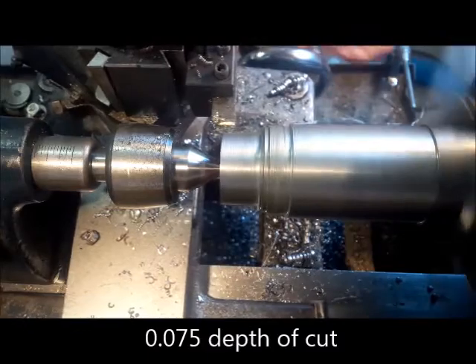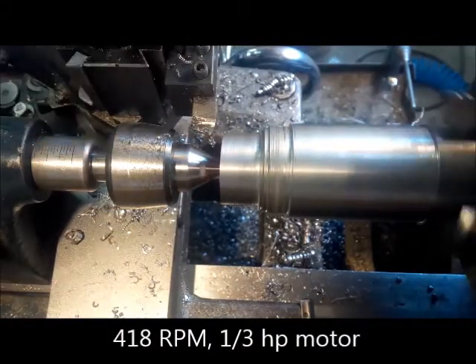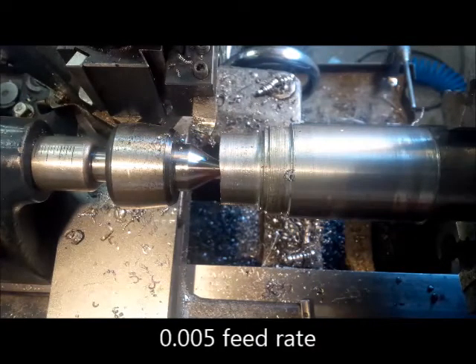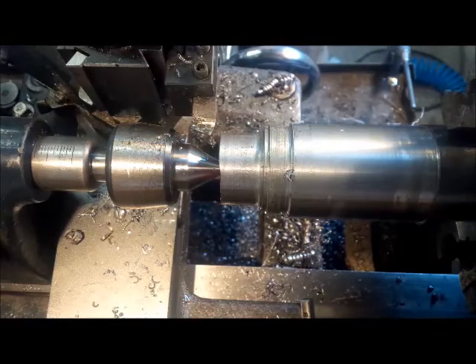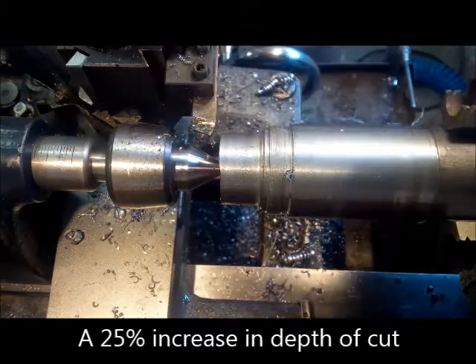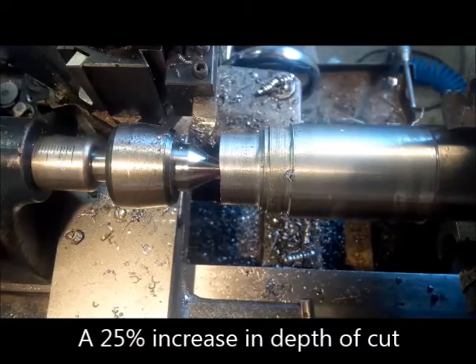By adding the lead angle and working on the finish of that tool, so I'm going to keep playing and see how far we can get. So that was 75 thousandths — 15 thousandths better than the first time. Thanks, Tom.